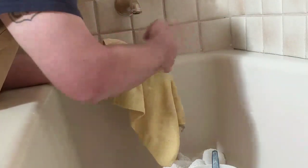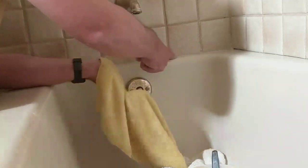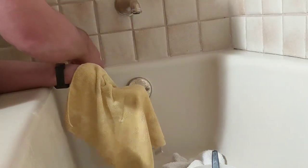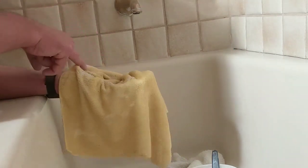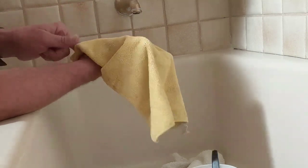Give you a closer look — you can tell it's on the thin side. When you do a wall, you want to wait until the product's at least 30 to 40 minutes old so that it's more likely to stay in there. So I'll have a kind of a donor rag that I'll wipe my finger on as I clean it off every couple inches. One of the nice things about this product — the reason we're doing this — is because you can color match. Unlike silicones, they're only available in a few colors: white, almond, maybe two shades of gray, and then black, brown, and horrible clear.